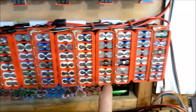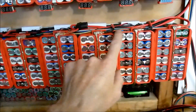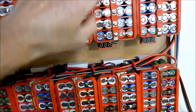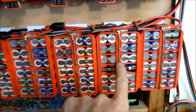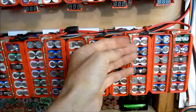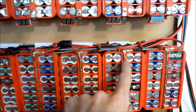The other thing I've done is I've built up another 1kWh pack from the cells in my power shelf — pulled them out and put them into a new bunch of my 3D printed cell holders. This time I did an experiment where instead of using my nickel-plated strapping — it's supposed to be pure nickel but it's actually nickel-plated steel, so it's not nearly as nice — I experimented with classic twisted mains copper cable, and that has worked kind of okay. I need to refine the design of my battery holders so that there's a recess groove that this can fit in, because at the moment it's slightly higher than the rest of the battery, so it's not quite perfect yet.